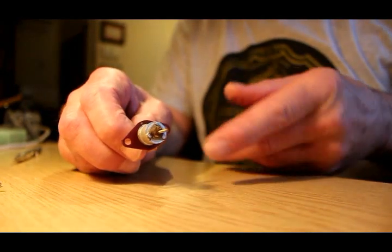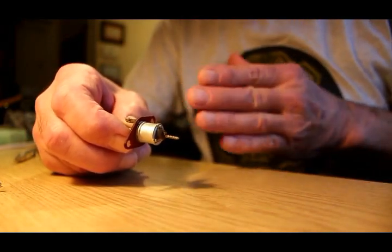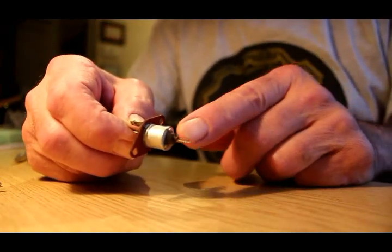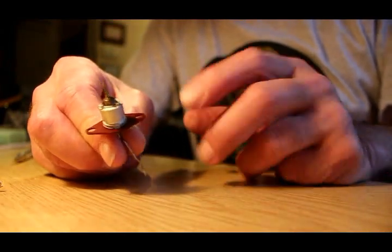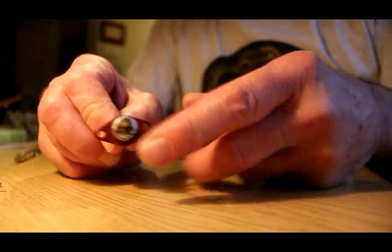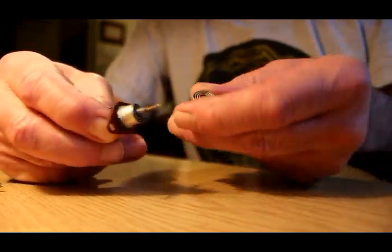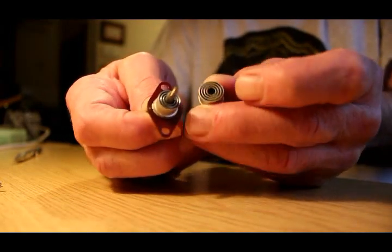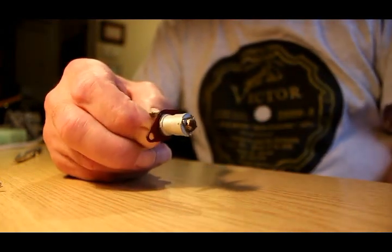Now we come down to the small ones, which are presets — something you adjust and leave in case you need to readjust. These are not large enough in capacitance really for use in crystal sets, but we're pursuing variable capacitors down to the smaller end. This is a Philips so-called beehive trimmer. It does have interlocking plates — if you unscrew it and pull off the top you can see concentric elements which intermesh, increasing and decreasing the amount of plate overlap. So it is a variable capacitor, though it doesn't look like any of the others.